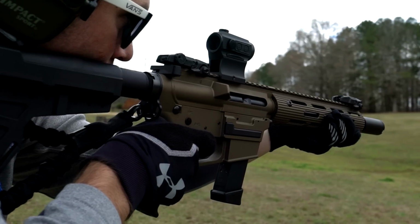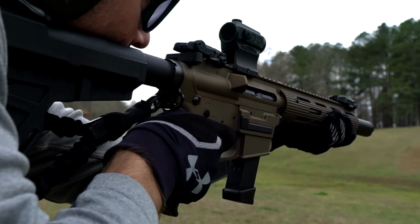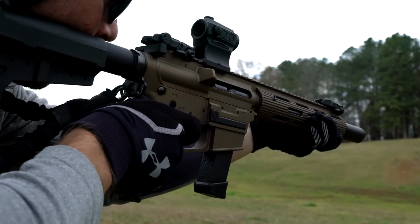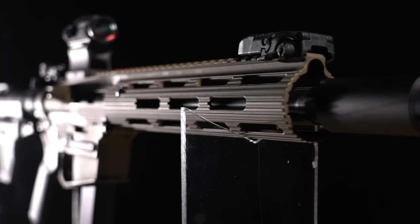This is one thing that I learned when I was building these that I had to learn because nobody told me, was that the barrel has no gas tube or gas block attached to it, because the AR-9 uses a blowback action just like a pistol. They don't charge the next round based off gases. They use it off of the blowback action from the first round.